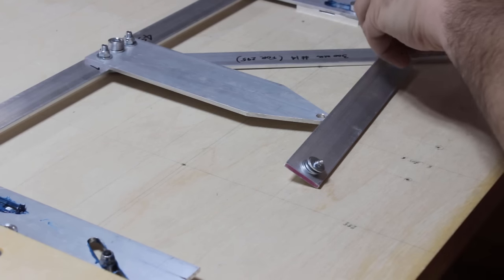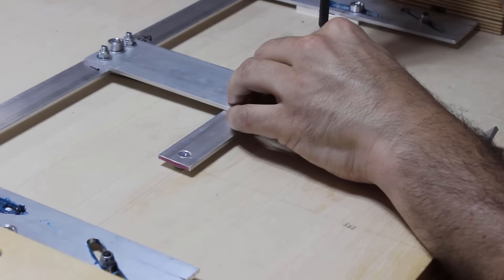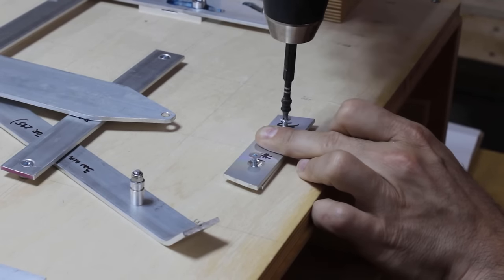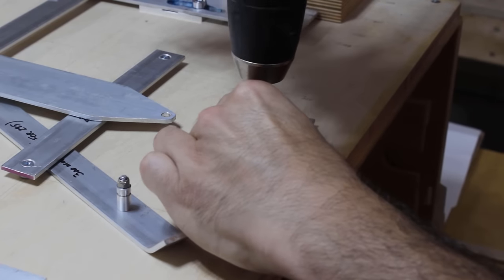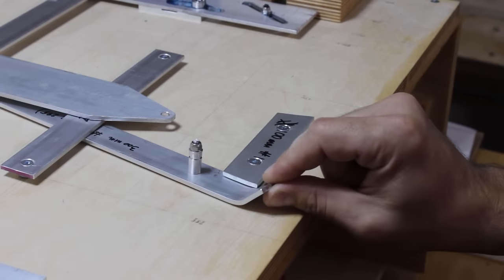The purpose of this lever is actually to delay the retraction of the locking pins, meaning that whenever you want to drop the saw down, you first need to pull this lever, which is going to put tension in the mechanism, and it's going to be pulling on those pins which are going to be held in place by the weight of the saw box itself. And then once you start to lift the box a little bit, you release the weight from those pins and they disengage.